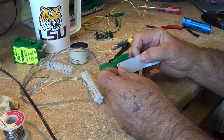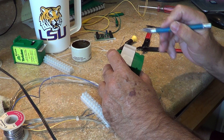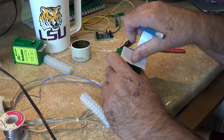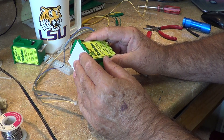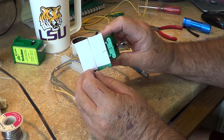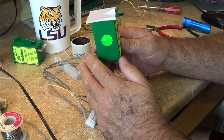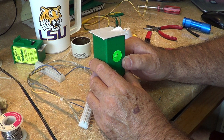The last step — and I think this is one of the most critical — is double-stick tape. See the thickness of it? Good old Walmart product. You take it, cut it here, put another piece here. When you get up underneath that table — and I have to say, I can't remember too many machines, if any, that I had help installing on this layout — this is invaluable. When you're installing switch machines by yourself, you peel the paper off when you're about ready to do it, then carefully line up the hole. The trick is to put a light above so you can see it from underneath.